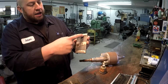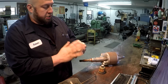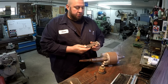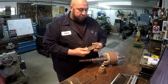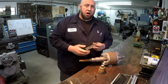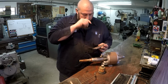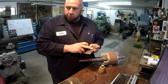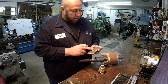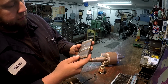This one right here on this side, okay, that is this bronzo chrome. And that's a really good powder for a lot of general build-up repair applications. It's machinable, and it's got very good characteristics in the powder that make it durable, tough, strong, wear-resistant and corrosion-resistant. This one in the middle here, I believe that was called Chrome Tech that I used. That one's also good, machinable, but the bronzochrome actually builds a little bit better.